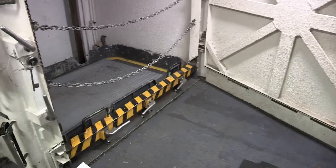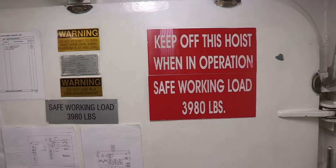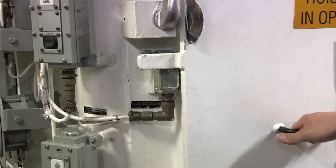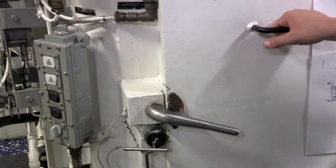When inspecting elevators, dumbwaiters, and vertical storage conveyors, you should find safety and operating instructions posted in the vicinity. Rails and guides should be clean and well greased. All operating and safety switches should be in good order, clean, and properly positioned.